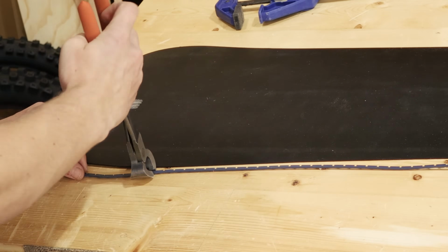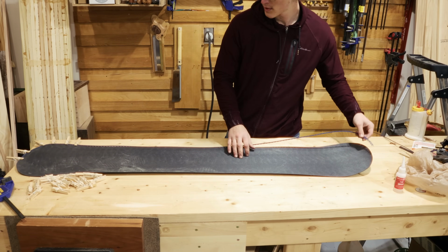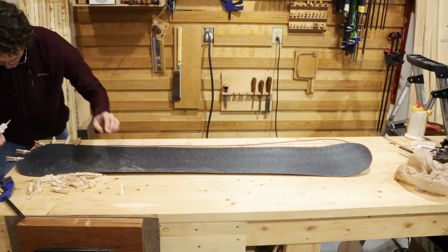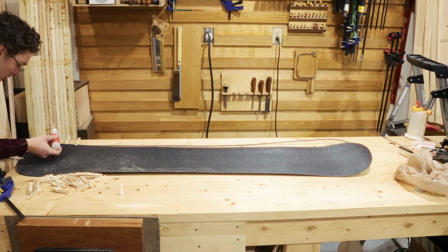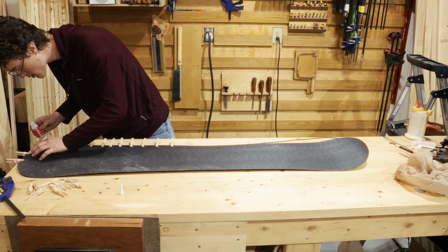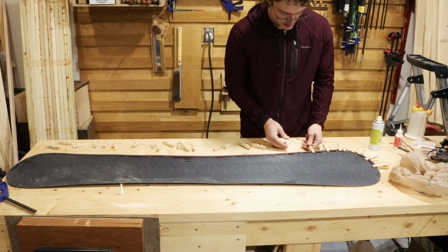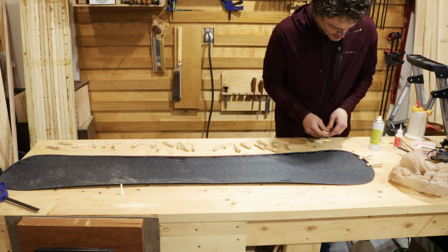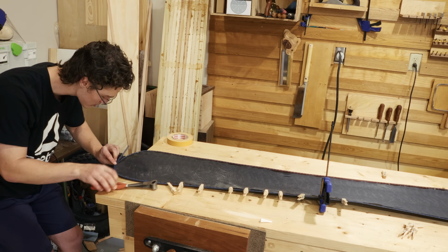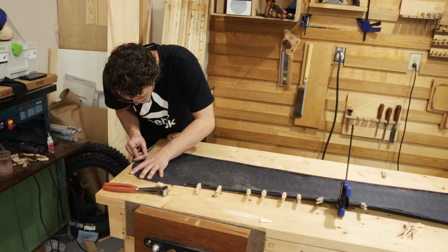Then I used some of these top-of-the-line wood clamps to hold the metal edge tightly against the base while applying super glue every couple of inches just to tack it on. The epoxy would later seal it in when pressing to permanently attach it. Then I went ahead and did the other side, trimming off the excess edge, which I can't show since my camera battery went on strike.